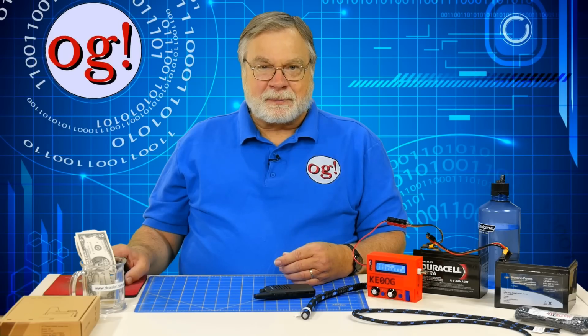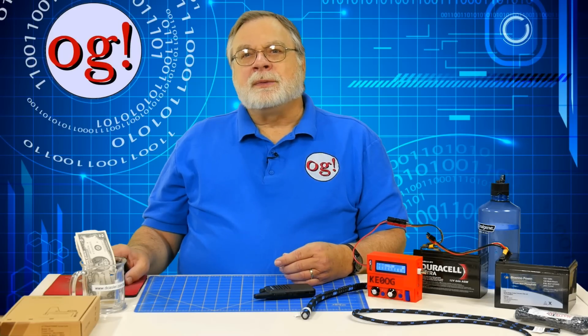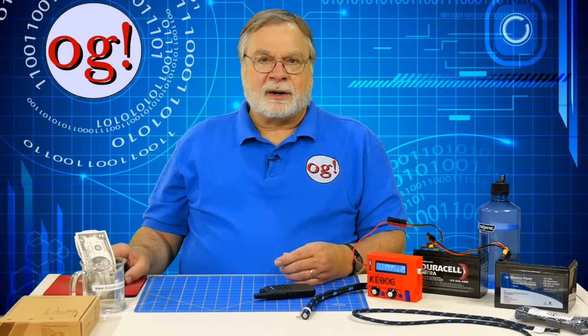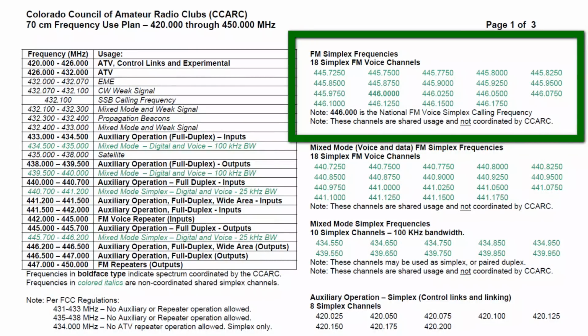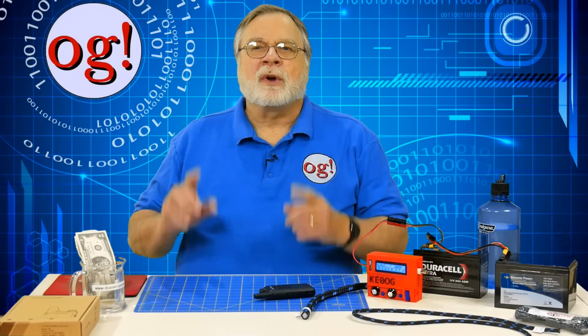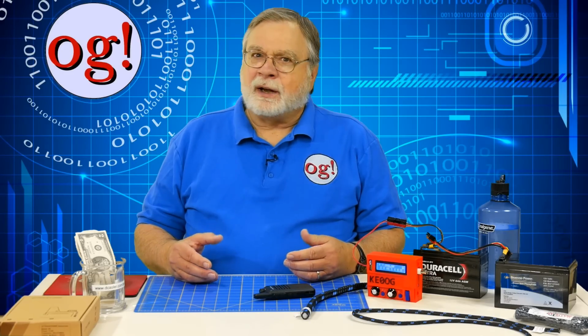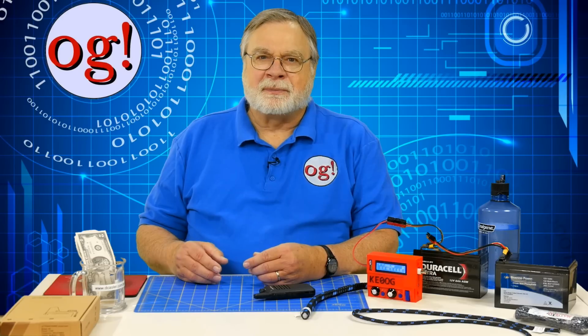few options. Unlike on 2 meters, 70 centimeter simplex frequencies vary from area to area. So I found Colorado's frequencies on the web, which you can see inside the green box. I programmed the first 16 into one radio, then cloned them to the other. Now these are ham radios and require at least a technician license to operate. You cannot get a more basic radio than this one.